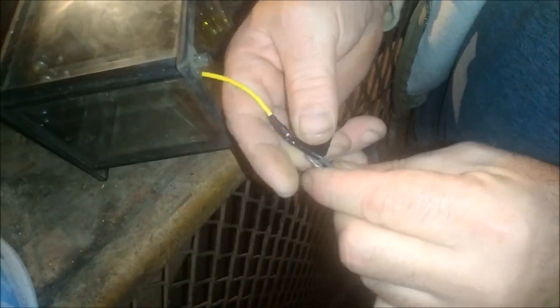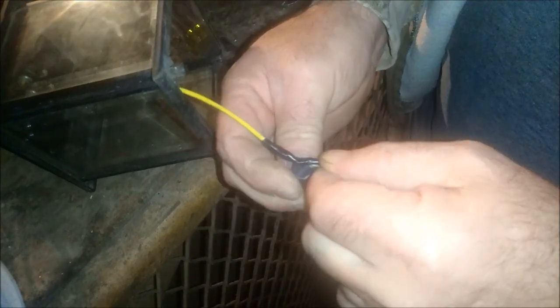Tape your second wire a little bit lower down, because you don't want all three to join in the same place — it makes too fat of a connection to pull through. This might be a little difficult because it had real thin wires through here before. There's also a plastic grommet on there to stop the union of the pipe from cutting your wire, so you also have that issue. It takes one hand to pull and one hand to push, or at least prop up to keep it straight. If you get it the majority of the way through, you can get the electrical tape off — then it's problem solved.